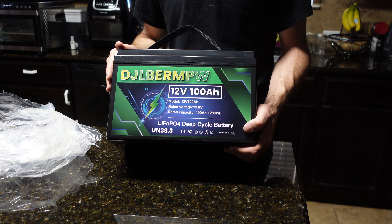Back in the workshop after the capacity test. On this battery the case was just glued at the top, so I was able to pry at the seam to release the glue without cutting it open - which is good since I plan to keep using it. Inside it uses two wires, roughly 8 or 10 gauge, going to the main terminals with some coating to lock them in place. Pulling off the fiberglass sheet reveals the BMS.